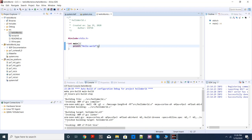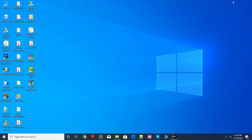More details you will see in your lecture. So through that interface, Zedboard will send this output to your computer. Now you should have some software here which can accept that information and display it on the screen. The software that we are going to use to do that is called Teraterm. So you should also install Teraterm if you're using your personal computer.